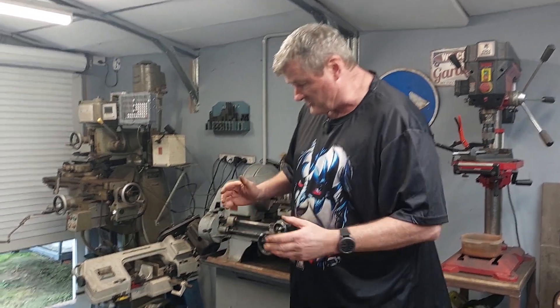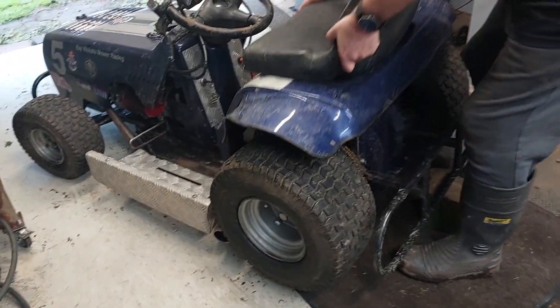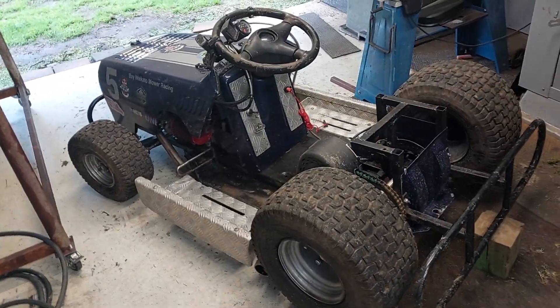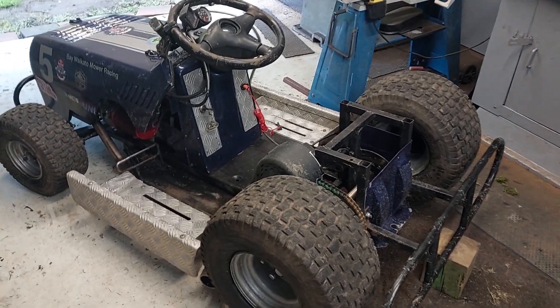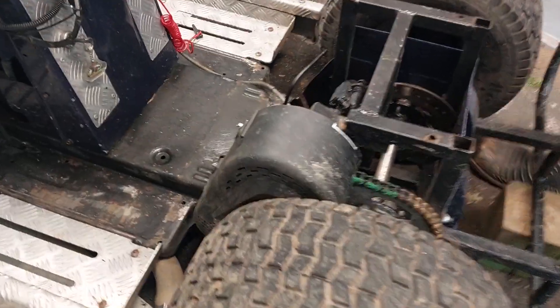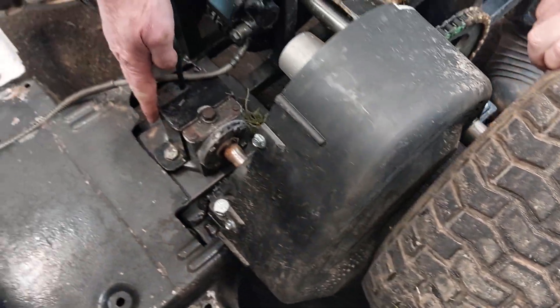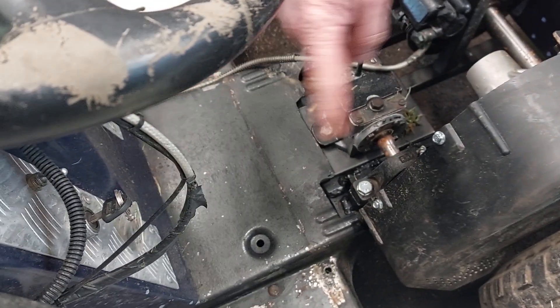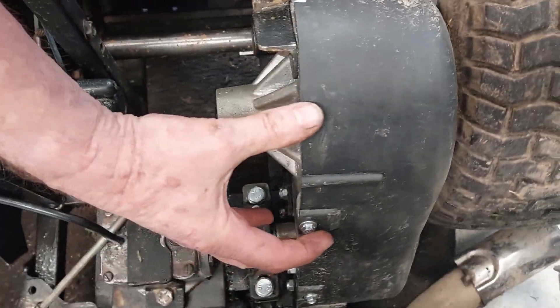What I've done is I've squeezed it into this mower here, so I'll just show you what it looks like. I'll pull the cover off. So this is what it's looking like inside the mower — I've got my full CVT in here, I've got my normal right-angle gearbox, it's got a normal belt just like any other mower. I've extended the shafts and it comes through to the CVT.